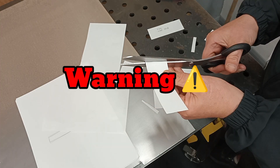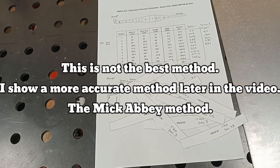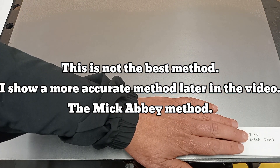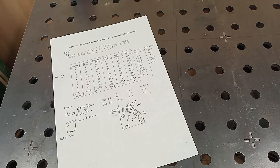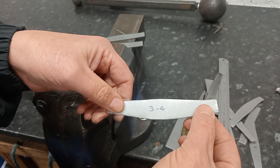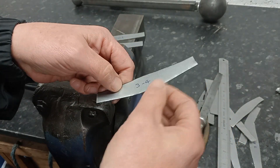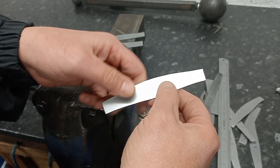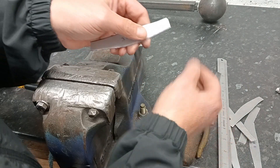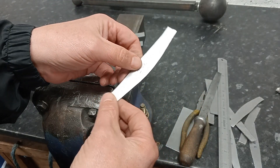It just remains now to lay all these patterns out. I'm going to go through and check them all, scuff them around with a bit of cloth just to take the edge off and give a good surface for welding, and then I'll bend the edges over a piece of tube just to get it started and stick it through the slip roll.